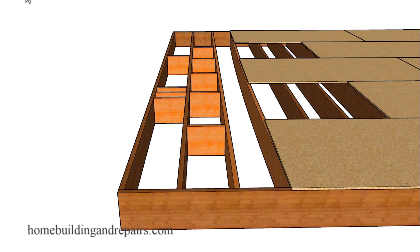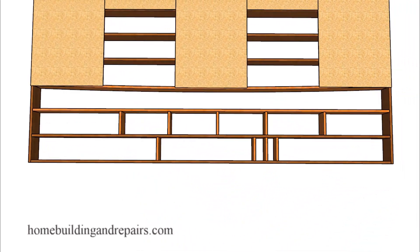That would look something like this after you're done. You might only need one or two blocks — keep in mind that these blocks could create floor squeaks later on. The more blocks you install, the higher the probability the floor could end up squeaking. If you're starting with a straight joist, measure the distance between joists to find the measurement for your blocks, then wedge those blocks into place to straighten the joist out.